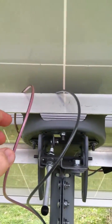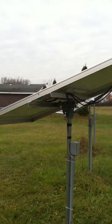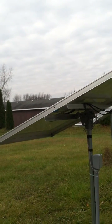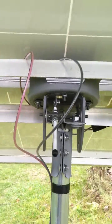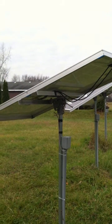I put a meter on here, loosen all this up and do it at noon on a good day. I'll have to adjust these pretty soon down for wintertime because they'll want to be at a lower angle. I just adjust them for maximum current and I get rated current on them on a regular basis, as long as we've got sunshine.